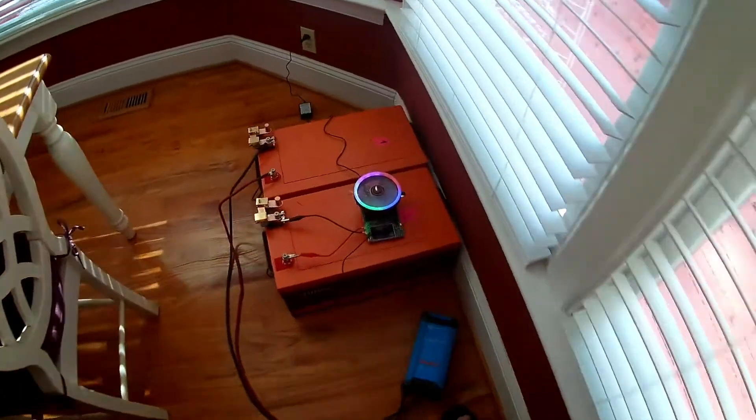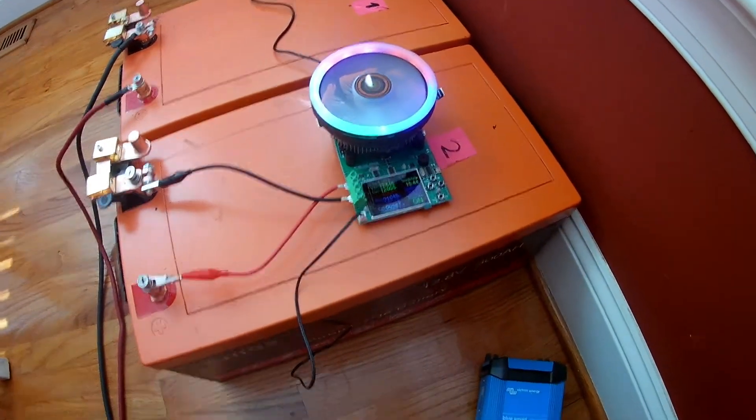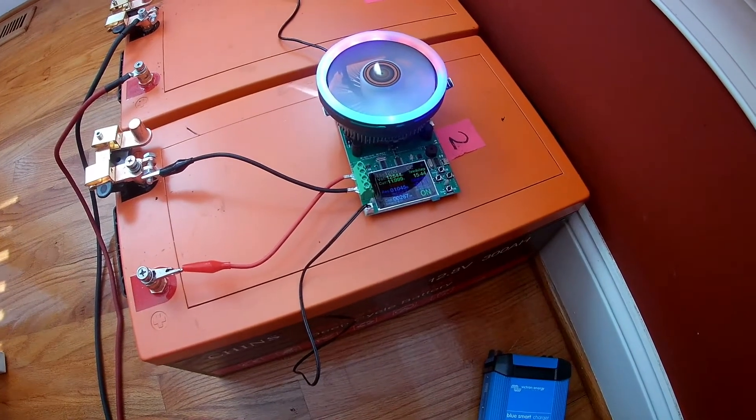You also want to check the capacity of the battery. If it says 200 amps or 300 amps, you want to test whether it's really 300 amps. There's another benefit too: as you plug your battery in to test the load, you're learning what the voltage does at a certain amperage. In my particular situation, I have 300 amp-hour batteries.